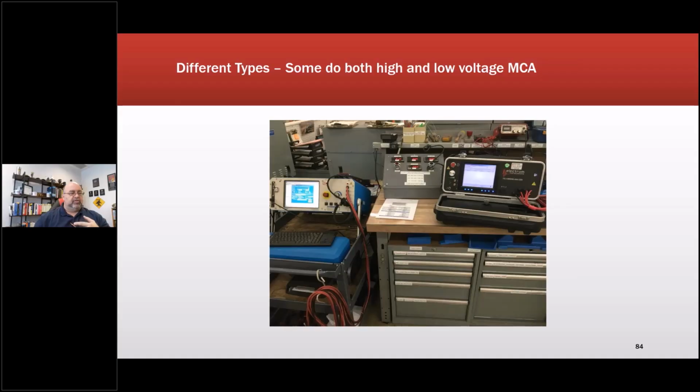Yeah, okay, so the question has to do with another aspect: a point that PI should be ignored if greater than 5 gig. I covered that. That's not changing in the new IEEE 43 at this point. Don't know where it's going to head. Our next meeting is in September. And I know you're an IEEE member. You can always look at it; it'll be the materials subcommittee. So it's part of PES, and I think you're part of PES as well, without mentioning your name.